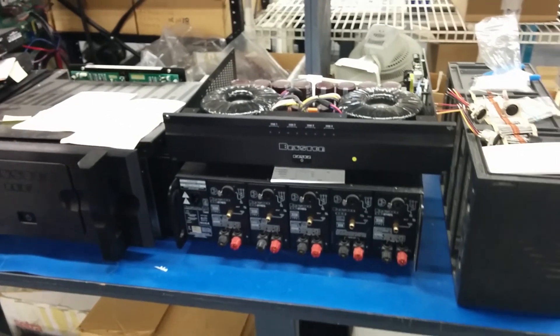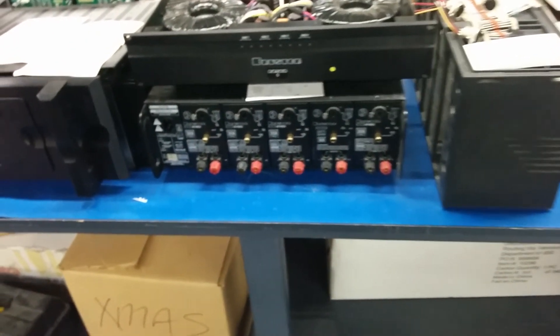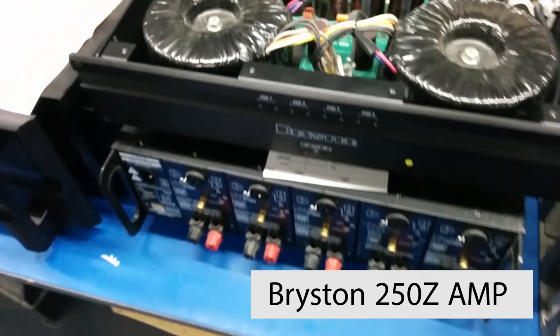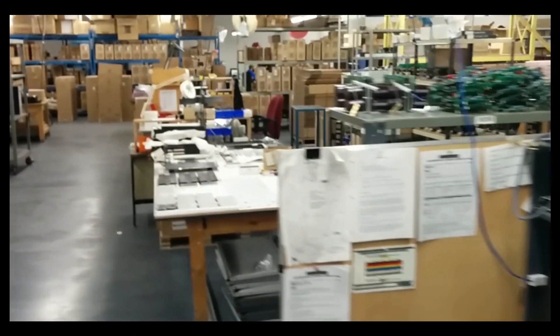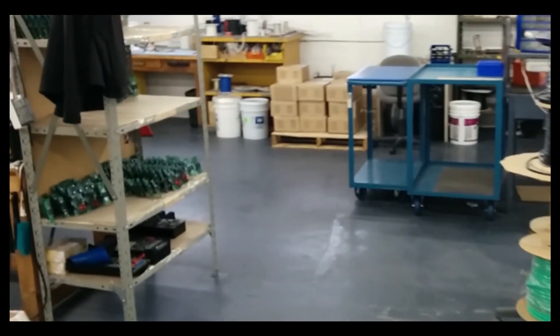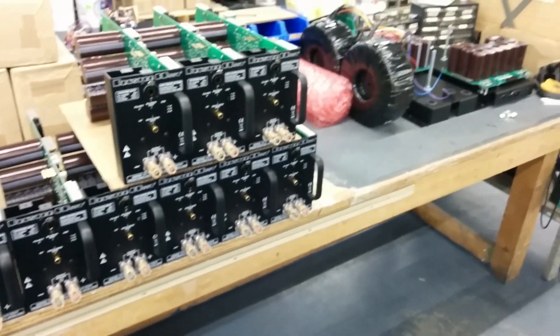What's that? It's a 9D — a five-channel amp. This is actually one that we discontinued in 2002. It's a home theater amp — lots of clean power for different channels. Beautiful system. And that's a zone amplifier, called a D256 — it's a digital output stage, eight times 250 watts. This is a digital amp. These 4Bs are not digital — they're all class AB, class AB analog. That's a three-channel unit.